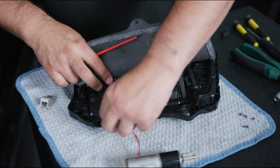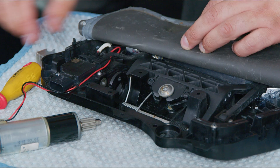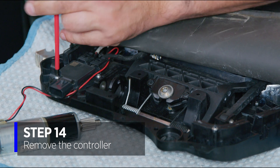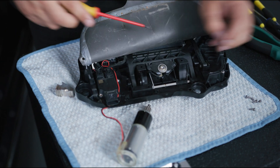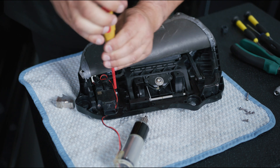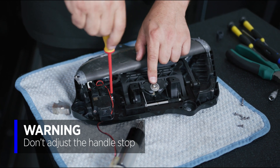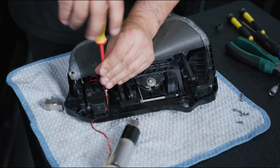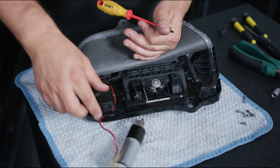We can remove the motor from place, just unhooking the electrical cables. The next part is to remove the controller; this gives us clearance when we refit the paddle gear with the bar and the position sensor of the handle. Don't adjust this element here — this is the handle stop and it sets the handle position. We only adjust that afterwards if required, but honestly we shouldn't need to.